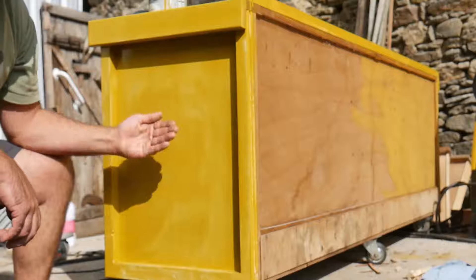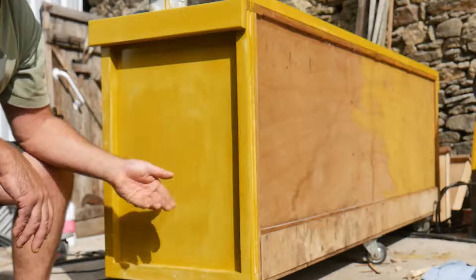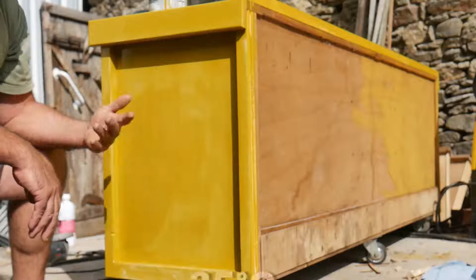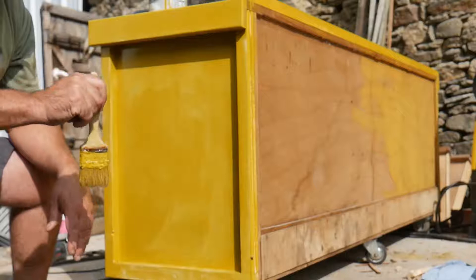Today I'm going to show you how to paint a vertical surface. This has had a couple of coats so far and these are the final coats, but it's more about brushing out. I've seen too often where people have painted a vertical surface and there are runs everywhere — they've applied too much paint or the paint is too thick. Today is a pretty hot day, fairly early, about 10 o'clock.